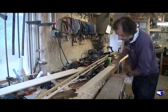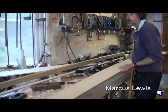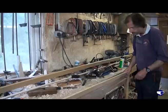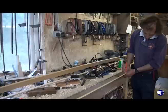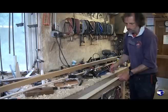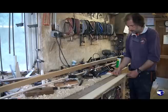At the after end we do the same thing — just slide our plank along the bench. Now when we have the plank clamped up on the boat, we mark the transom, which I'll just mark through on the other side. Because obviously it's that point that we want to be half the plank thickness, so working away from there — 16 inches — start there, half way down on the transom.